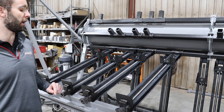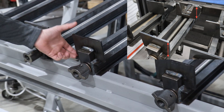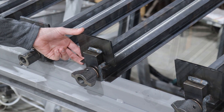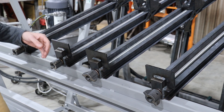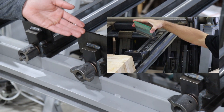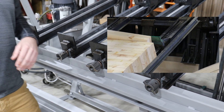The other specs on the clamps are the jaw height. The standard ones are 2.5 inches. Here we have 3.5 inches that came as an option. This is mostly used for face gluing or just thicker applications. So if you're doing thicker material than 3 inches, you could also use clamp extenders that come as options — they can be 4 inches or up to 6 inches — and they are a part that you add onto the jaw and onto the mobile jaw as well.